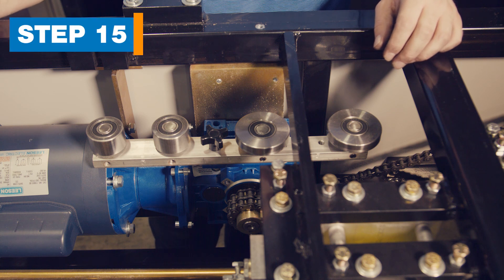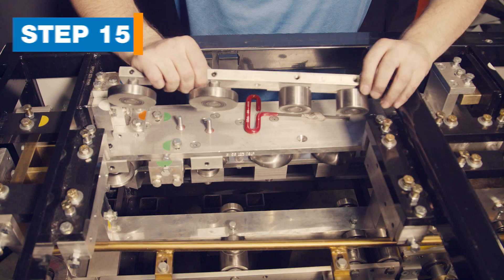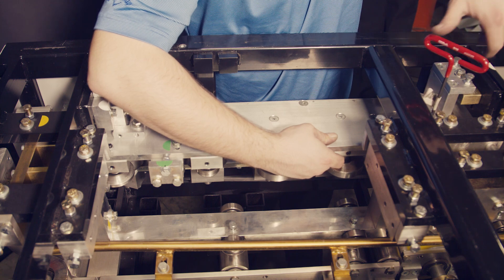Step 15. Install the 5-inch inside roller assembly. The 5-inch inside roller bar is located on top of the blue reducer box and is held by one thumb screw. The stamp number will face outward. Install the roller bar with the red allen screws removed earlier. Don't over tighten the red screws.